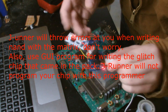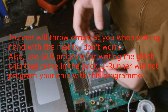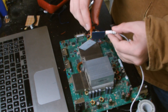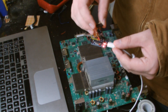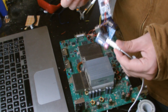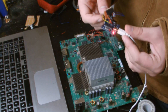Here's the finished product — as you can see, it works. I actually just programmed this cool runner so I could do an RGH 1.2 on this Jasper. The only problem I had was that when I put the wires onto the little connector header, there must have been a short or something and it wasn't programming, but I just soldered the wires directly on and it programmed successfully.